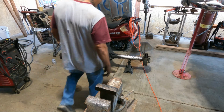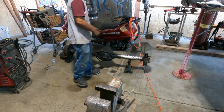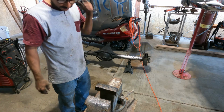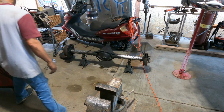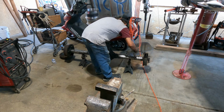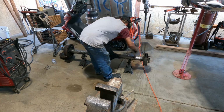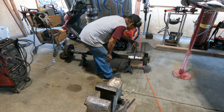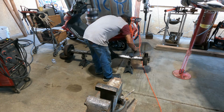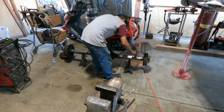Alright, gonna get on repairing this axle now. They say I got some cracks to repair, some divots. Gonna weld them all up, grind them, weld them, grind them again, and then we'll start mounting the axle brackets. Once we get those all welded up, we'll figure out our measurements here. This needs a little more fitting, but we'll figure out our measurements, and we'll get these on here and squared up and welded on to the right angle, or tacked on, I guess, for now. The right angle of the pinion, with the right angle of these, and yeah.